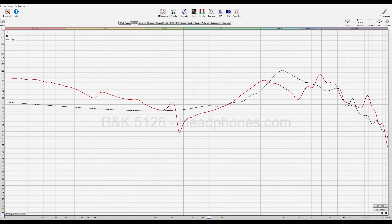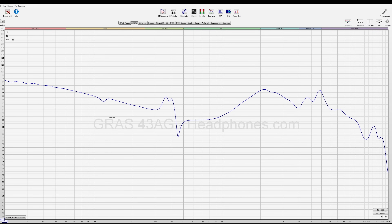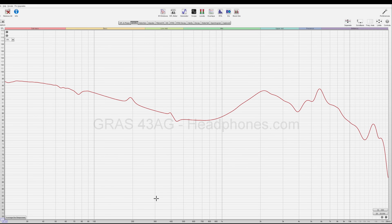Now I want to get to the more significant deal breaker, which is what's going on in the mids. You can see there's a bit of a wibble going on here — a peak and then a dip. This is just one seating; let me show you another seating. This isn't to do with channel matching — just a different seating on the measurement rig. But with this seating, this mid-range feature shows up quite strongly as a peak. One possibility is that it could be the bone conduction driver and the way they've implemented that. On the GRAS system, this resonance shows up again with a deep insertion in the canal extension tube, but when I use a shallow insertion, that feature basically goes away.